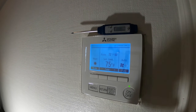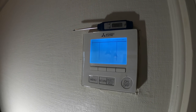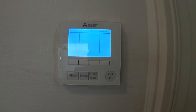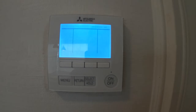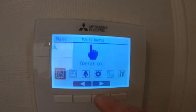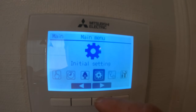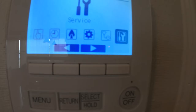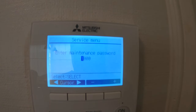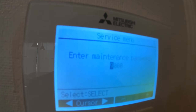This board is a little bit different than the other one — it's the same style of indoor blower but a different unit. The only thing identical is the thermostats, but what's different is how you change the temperature. It's really unfortunate — I looked everywhere for the cover. I can't get proper information from this unit if I don't know what unit this is. We're going to start by turning this unit off — click the on/off button. Everything just stopped. Now we're going to get into the settings. We'll click Menu, scroll all the way to the right — we have Operation, Timer, Energy Saving, Initial Setting, Maintenance, Service. We're going to click Service, then hold OK, select for Service. It's going to ask for a maintenance password and the standard default is 9999.